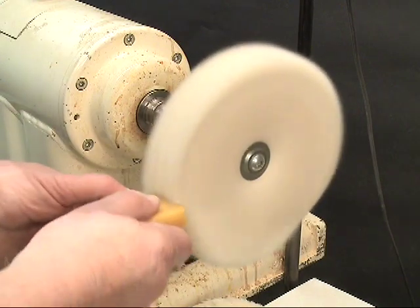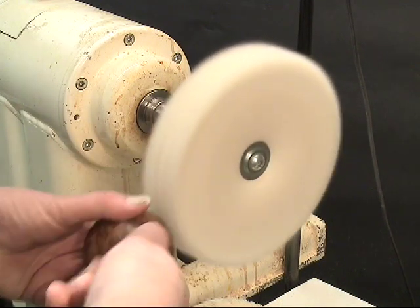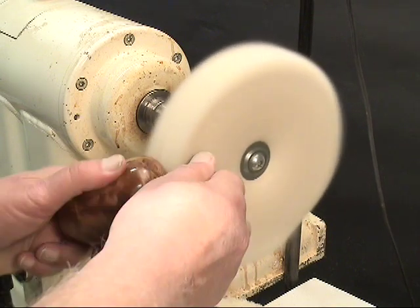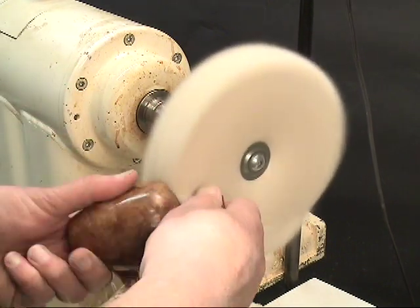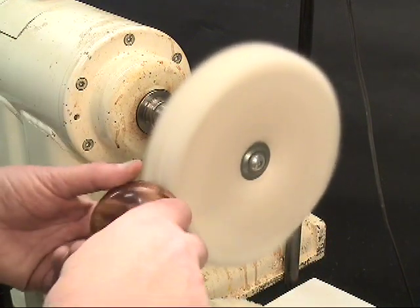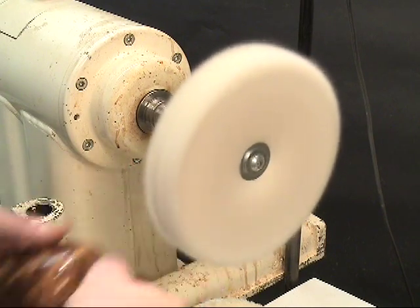Change the wheels and give it a coating of wax. It's better to use too little than too much. If you get too much, you'll know because it'll start to smear around on the surface. When that happens, you know you've got too much, and there's not much you can do with it. The only thing you can do is get the excess wax out of the wheel by rubbing the stick on it to remove the old wax, then buff the piece with no wax on the buffing wheel. If you have a big smear, just work on that a little bit.